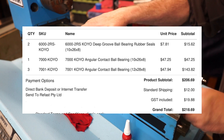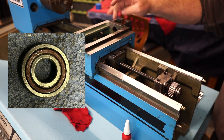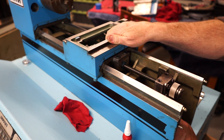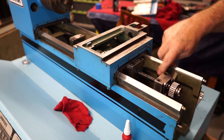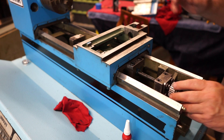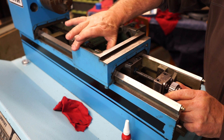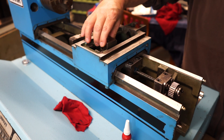I've replaced the angular contact bearings front and rear on the Z axis and I've got to put new bearings in the X axis now. The X axis has a single angular contact bearing arrangement — one here, one here — and when you tighten them they squeeze together. There's a limit switch that goes down in here with a little adjusting bolt so you can get full travel. There's another limit switch for the Z which triggers when it hits the tail stock, and an X axis limit switch hidden underneath, triggered by a similar adjusting nut arrangement.